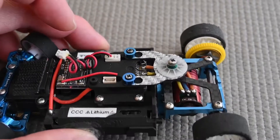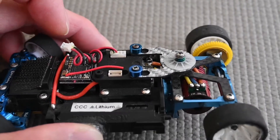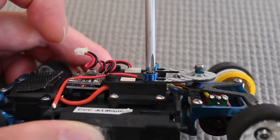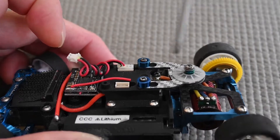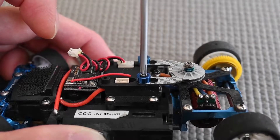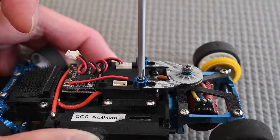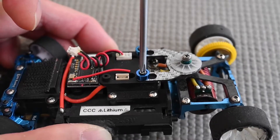Make sure that you use the correct size of driver in the screw. Especially with Phillips screws you want the one that fits snugly. For instance, this is a Phillips number one screw and it's a pretty tight secure fit. Now if I use a smaller one — say a Phillips P0 — you can see there's a lot of play and wobble. If you try to use that driver you'll have to push down really hard and you'll start to chew up the screw head and destroy it.